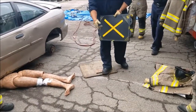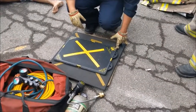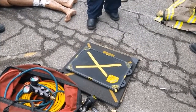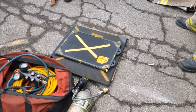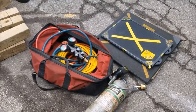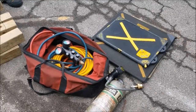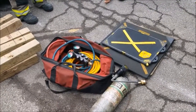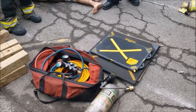When setting these up and stacking them, the X marks are the center. A lot of people keep the fittings on the same side, and it works that way, but it's much easier to keep track of your hoses if you put them on opposite sides and run them back. You guys have red, yellow, blue, and orange hoses. The squads have black, red, blue, and yellow. I'd suggest putting the black hose between the regulator on the bottle and the airbag controller, because in the middle of the night it's much easier to say 'up on yellow' or 'up on blue' than trying to trace which black hose goes where.